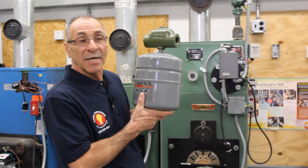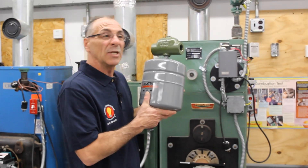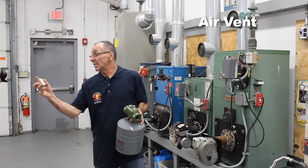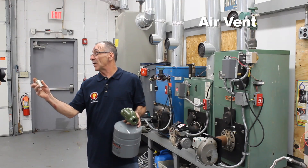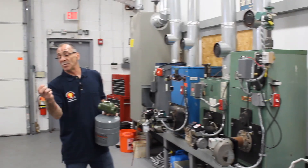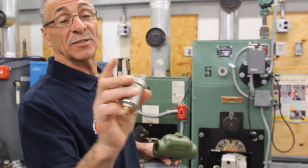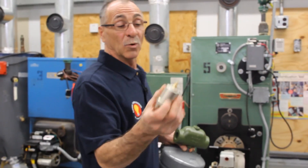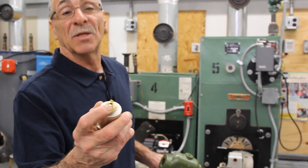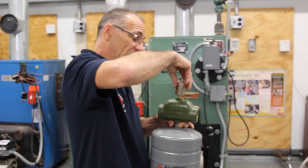We don't want air in a system due to the fact that the air will restrict the water flow. It usually is at the highest point of the boiler. This is an air vent — this here must be free. Do not break this or bend this. This top piece should first be tightened, then slightly loosened. Do not remove it all the way so the air can come out. We also have threads on here — this must be doped with pipe dope and/or Teflon tape. It screws into the top.